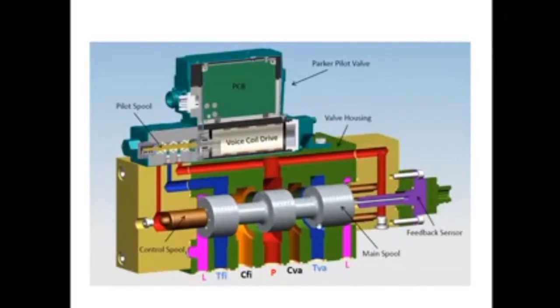From the feedback sensor we receive a signal that the FIVA was activated, so the system will know that injection or exhaust was activated. Through channel 30 and channel 70, which comes from the CCU — cylinder control unit — we receive a signal that goes to the PSB, which activates the voice coil driver. A pilot spool will then move in one direction, initializing the oil flow through the system and starting the injection process.